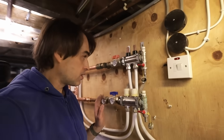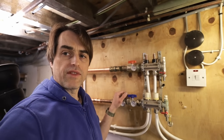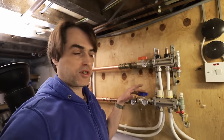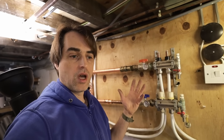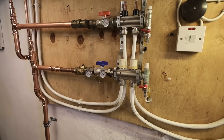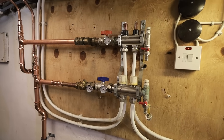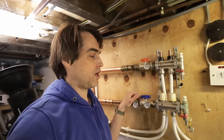We've got the existing manifold for underfloor heating in the kitchen - that covers around 20 square metres. I've removed the circulating pump for that manifold and removed the thermostatic controls because the heat pump setup we're installing is low temperature anyway. The pump on the unit is fully capable of supplying both underfloor heating and radiators and overcoming the pressure loss of the system, so we don't need a separate circulator for the manifold. Behind this door is all the pipework that still needs to be insulated - I'm sure Peter will have fun crawling back there.